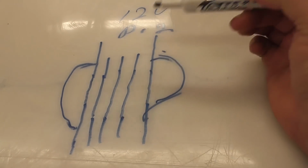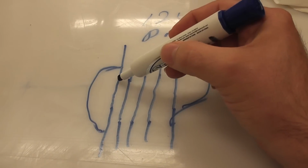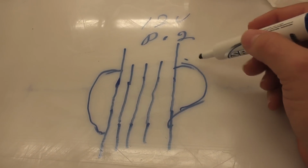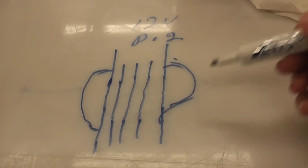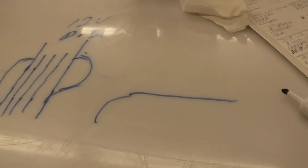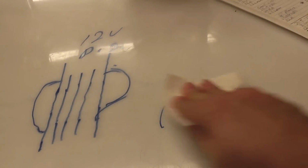What does that mean that I'm drawing these lines? Well, you doubled your surface area. So you increased your surface area by double. And increasing surface area does not necessarily mean you're going to double your output, unless these cells were like 4-inch squares and then you added another 4 inches, until you maxed out your current where it plateaus. It's going to go up and then just plateau once you get to a certain amount of surface area. Okay, that's one of the biggest questions people have about these is, well, how big should I make my plates? Well, no bigger than a 9-inch square with a 1/2-inch gasket, or however you want to look at it, however you build your stuff.